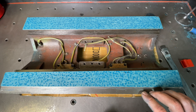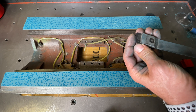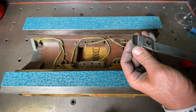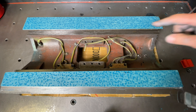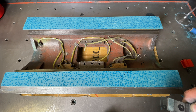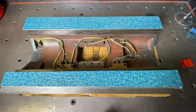All right, this side is done and I'm just going to flip it over and do the other side. For carbide I'm actually using not my regular one — this is ground with a 12-degree negative for Turcite. Also all these pockets are much deeper than when you scrape cast iron, at least one and a half or two thousandths deep. That's why when it comes to Turcite you don't need any flaking for oil.